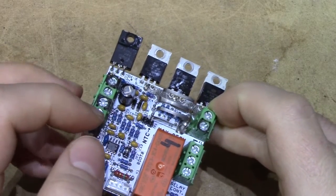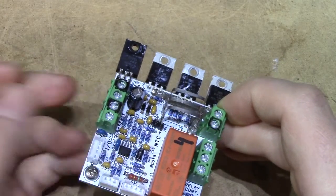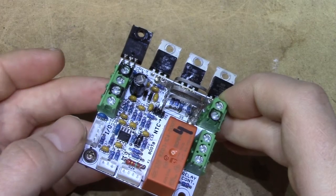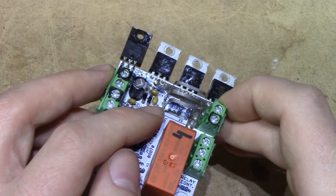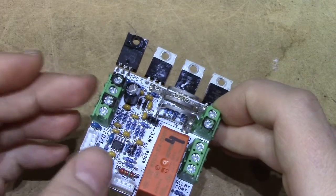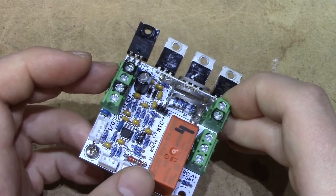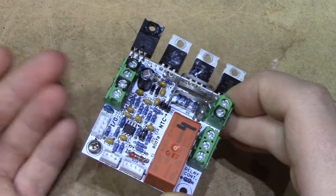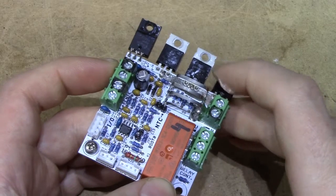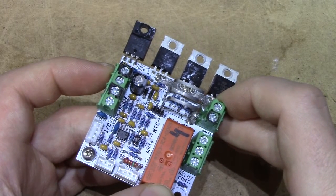It also allows us to use basically any random cables we want out of the front panel of the box without affecting the measurements. While it isn't implemented in either software or on my boards yet, these units also have support for an NTC resistor on this pin header in order to provide temperature compensation if necessary, but primarily to provide over-temperature protection. Since we're running such tight thermals, it's really important to keep that in mind. If we have a fan failure and we don't have any per-board thermal protection, all the boards are going to destroy themselves, because dissipating 100-something watts through these transistors into a passively cooled heatsink is just not feasible.